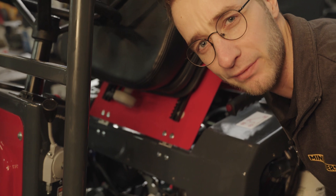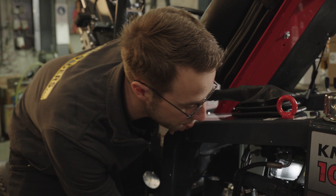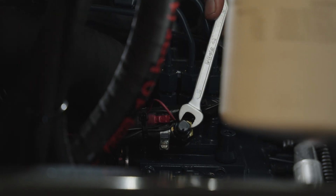That means the diesel fuel filter is full of fuel, so now we can tighten that bolt back up again. Next up, we have a 10 millimeter bolt on the engine block itself which we also have to loosen up.